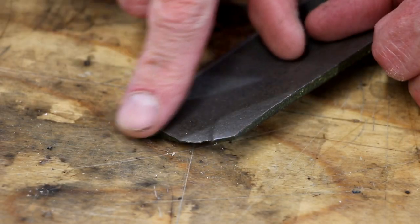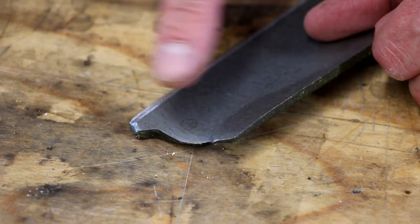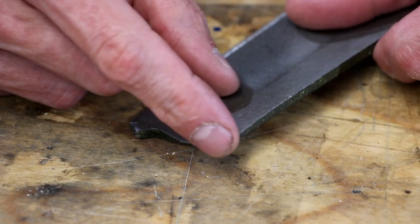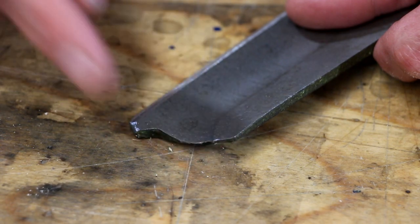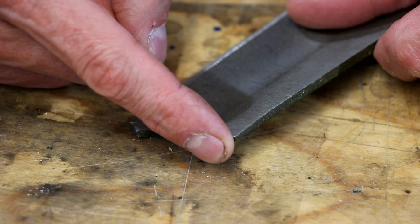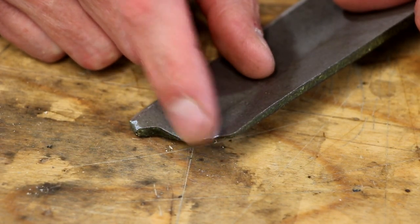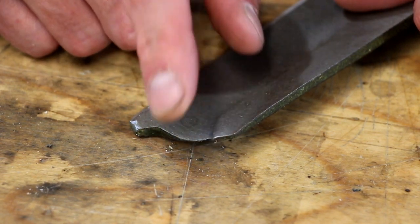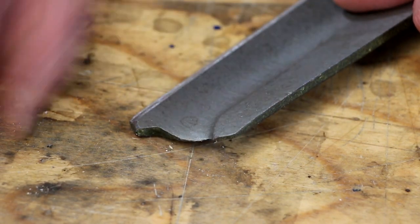I'm going to begin with a visual inspection of my blade. I tend to check the end first because that's where the blade really starts to take a beating. I can feel on this one that it almost has a knife edge on the end — that tells me this blade is beginning to get worn out and I probably should get ready to replace it. I don't feel any pieces are going to fly off and cause a dangerous projectile, so I'm going to sharpen this one and put it back on. I think I can get at least another round or two of sharpening before it gets too banged up.